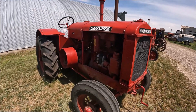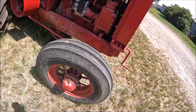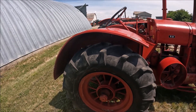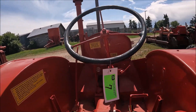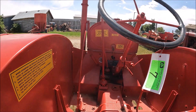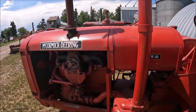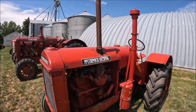Here's a W30. This one's earlier, but these are not cut-off — the ones with the round spokes are factory rubber. This has 6-16s up front — new tires. This one's only got 14-9-24s, which are way small tires for the tractor. This is a nice little W30, actually. Serial number about 25829, so I imagine it's about 1937. Nice and straight — well done. The manifold needs attention, but other than that it's a nice tractor. A W30 for you.